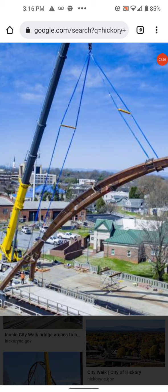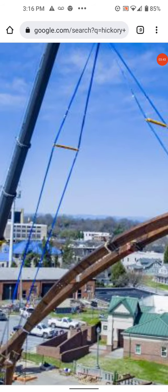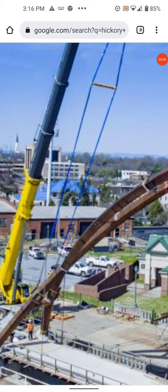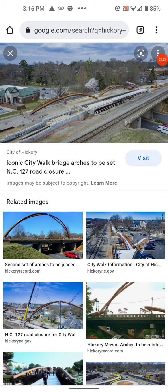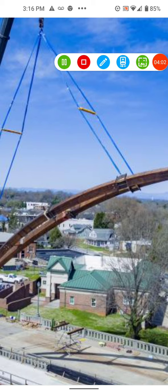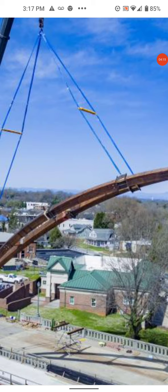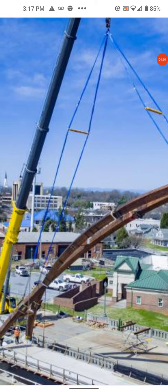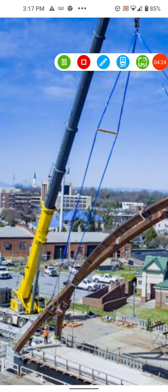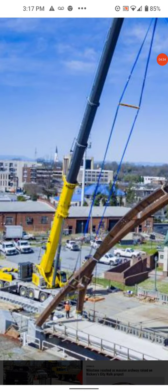This looks like a link-link system. Looking back at the equipment, it looks like it's almost tied here. So we have our connections here with a spreader bar — they're not down here but up there at the arm. This one handles the redirect and stability. The blue one — there's nothing connecting here — so I'm wondering if they had this thing laid down, two cranes put it in position at the abutments and then started lifting it up.